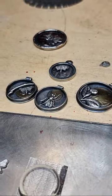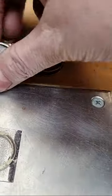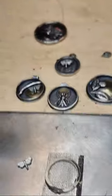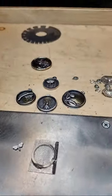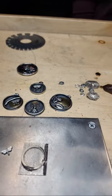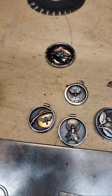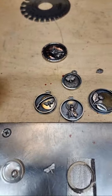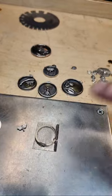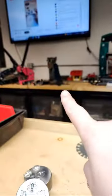Besides having a back plate and a frame, the key is practicing sweat soldering and learning how to get these multiple elements together without leaving much cleanup required — that's the basics of creating a shadow box. There is a handout uploaded for this demo in the files section of the Powder People Facebook group. If nobody has any questions, we're going to first show you how to form a frame using the Quick Form Press.